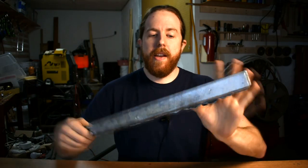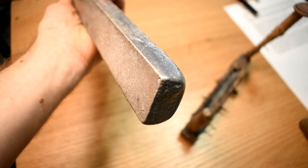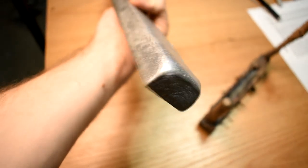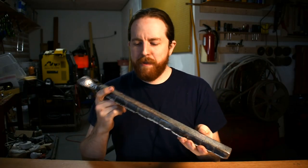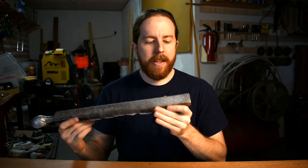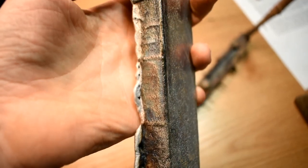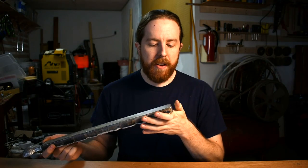Now here's the aluminum one, you can see it worked just fine, but it lacks nice crisp edges along the place where it poured in, and especially near the ends. You can see the ends are rounded over, like there's a huge amount of surface tension. And the corners underneath, the bottom edges, also didn't form very cleanly. The wood had sharp edges on it, and this casting is very rounded off. It looks terrible. It was not flowy enough to fill in those gaps. It should have flowed in just fine, but it didn't. And that's commercial level A380 alloy. I didn't make that alloy.